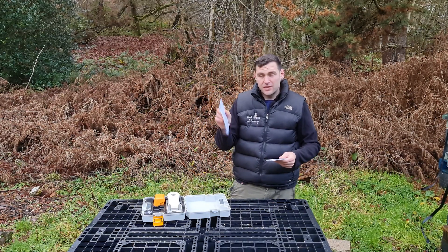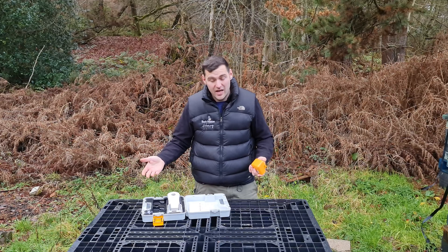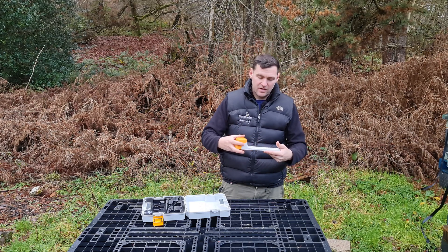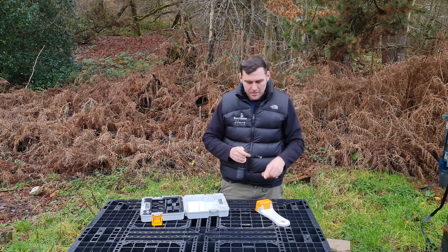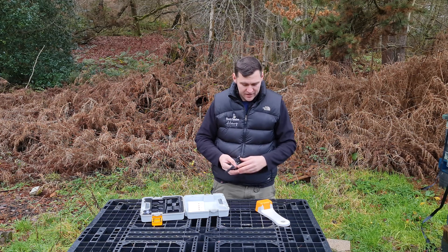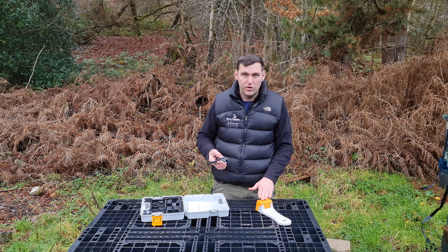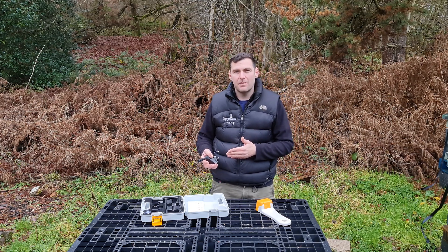You open it up and get a couple of instruction leaflets, which give you useful indications about the lights — I'll talk about those later. It's a really simple product: you get a wand and a battery power pack that just clip together — that's the assembly done. The battery is good for between 10 and up to 15 vapes of the hive. You can also buy additional batteries from Andermatt UK, so you could come out with three or four batteries and do say 60 hives at once. Otherwise you'd need to stop, take a break, recharge the battery, and come back out.